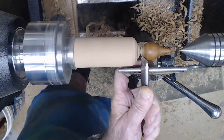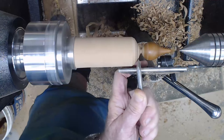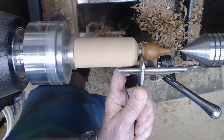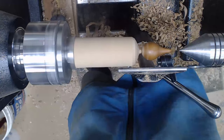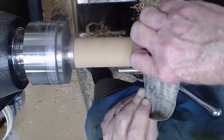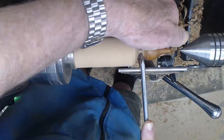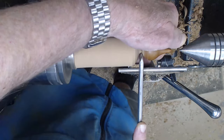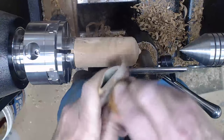I'm going to go ahead and put it in there. There's still a little bit of rough area there I think I can still hit. Reach over and part it off — don't grab it or you'll tear out some of the end grain. Just let it fall into your hand. There we go. I've got just a little bit of hand-sanding to deal with on the end here, but not much.